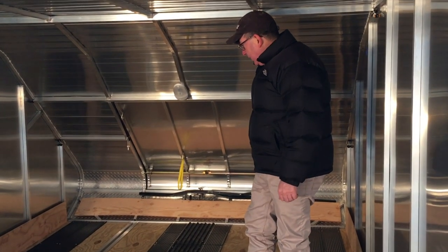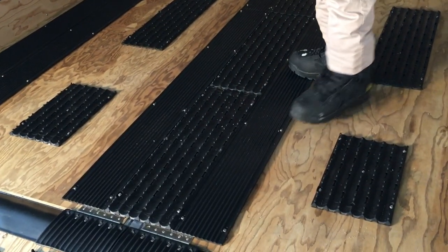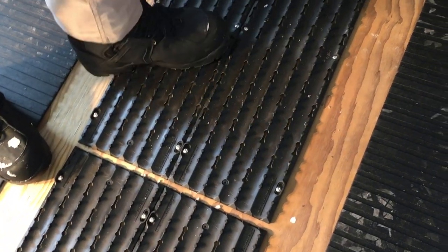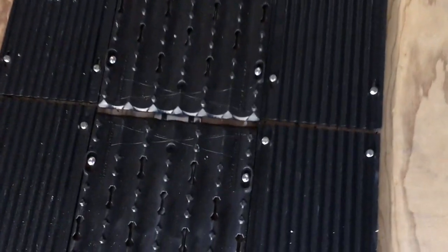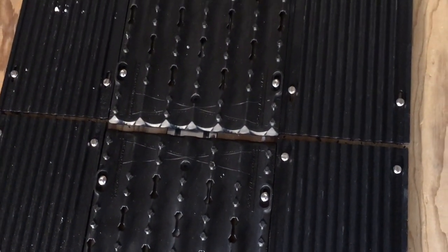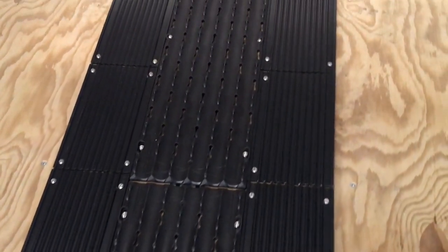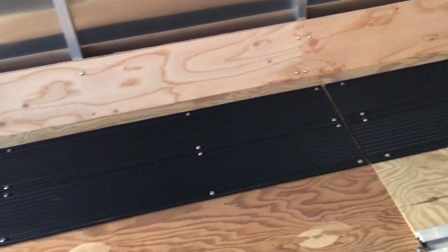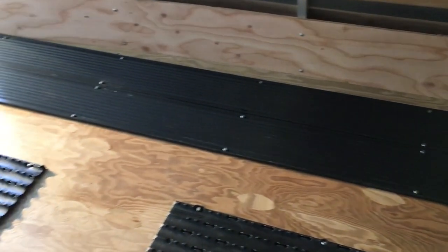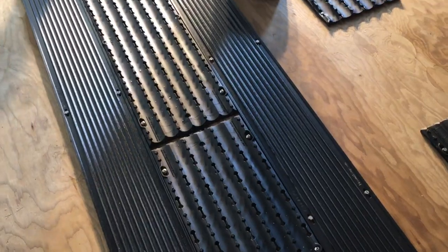I want to remind you to leave a 3/8-inch gap between all of your Grip Glides — and we did the same on the Black Ice glides — because in the summer when these things heat up, they'll actually fold up and get pretty funky. Caliber has done a nice job of providing a plastic sleeve that fits down inside each of the holes where the screws hold them in place, and it allows the grips to slide back and forth as expansion and contraction takes place without folding up or binding.